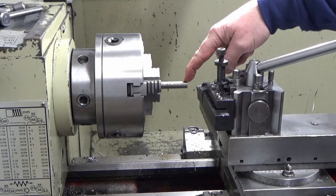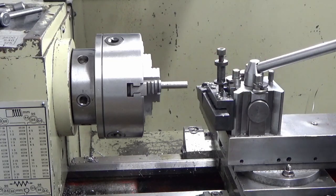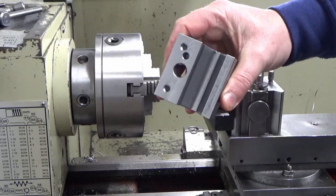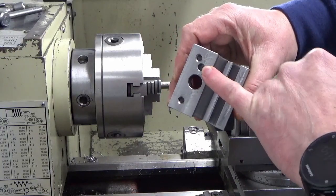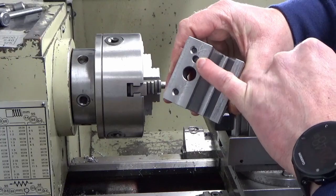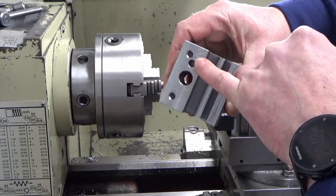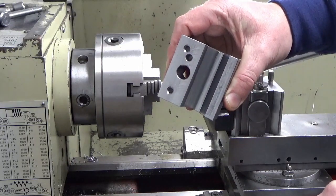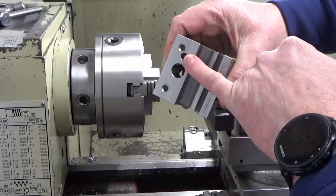I've tried a quarter inch shank end mill in the hole, and I've just taken the reamer back out again, and it appears that it's a dog-eared old reamer that I used. It appears that the reamer's slightly tapered, so it's slightly under quarter inch diameter. So if I head for quarter inch diameter with the bar, and then we'll just scratch away at it until I get a decent fit into that hole with the pin that I'm making. So we'll just do that now.